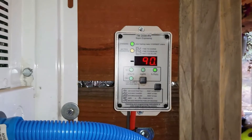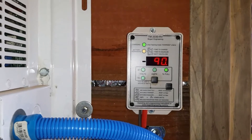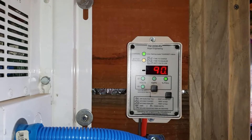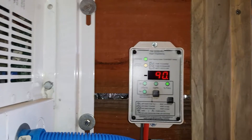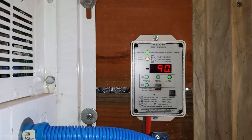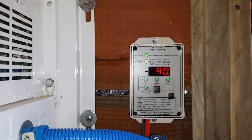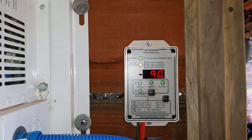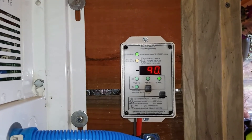What I did read from one source called Battery College is that battery wear is a function of amps in and amps out — the more power that has passed through the battery is what ages it. So if that's true, very light cycling would be best. But if there are areas of the plate that never get used because of light cycling, then a deeper depth of discharge — maybe to 50% periodically — would be good for the batteries.